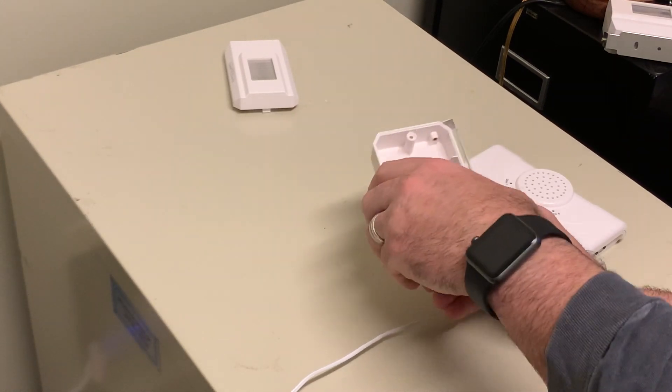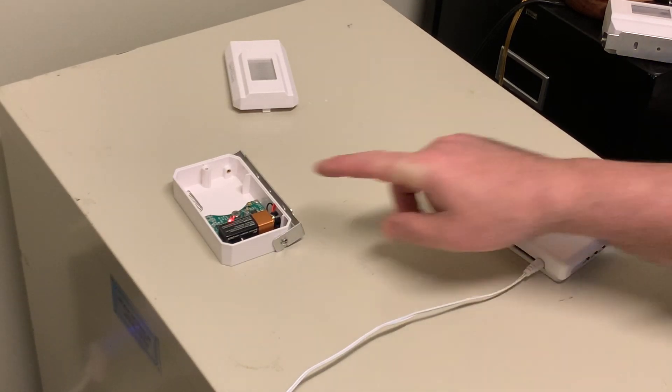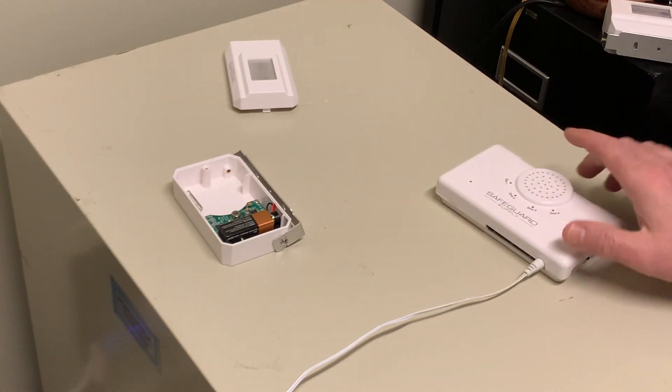I've inserted a nine-volt battery just to make this demonstration go a little bit quicker, but I want to bring your attention to a couple of things. You just saw that red light go on, and that's because the photo cell here detected motion and it went ahead and transmitted a radio signal. You can also manually transmit by pushing the test button located right above the battery. So I'm going to put this to the side — we've got everything turned on and ready to go. The next step is to put the receiver in program mode. This has four zones; you can program up to four transmitters per zone.